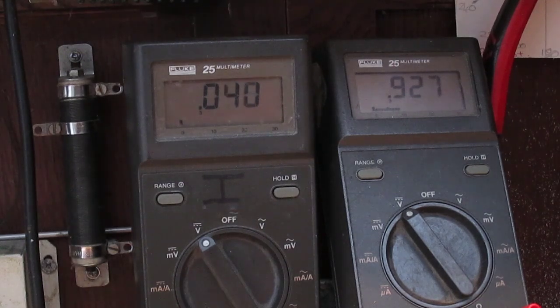And right, collector. So the first one we should have, the important one, is this junction of R11 D1. That should be at 0.5 volts. It isn't. Boo hoo. Next, let's make sure we've got collector voltage correct, which should be minus 45. Correct.